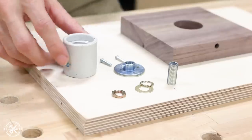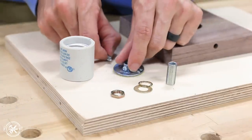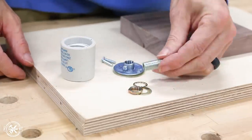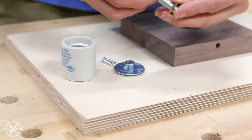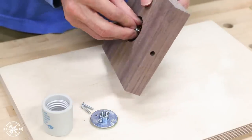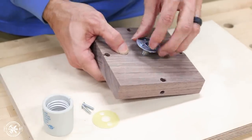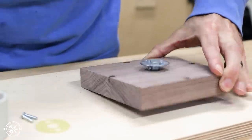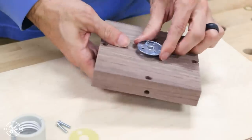Here are the parts I'm going to be using to wire up the lamp — it's a porcelain socket with a thread-on adapter. The socket and adapter are held in place with a threaded nipple and some locking hardware. I'll have a link below to these exact parts that you can order online at Home Depot. I set the lock washer and hardware onto the nipple and fed it through the base and into the adapter plate. The adapter plate has a small set screw that locks it into place on the threads. Then I used a wrench to tighten the nut and lock washer on the underside of the base for a snug fit.